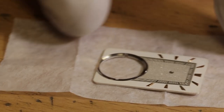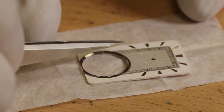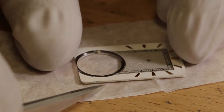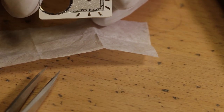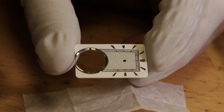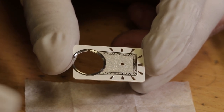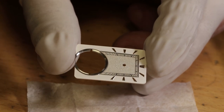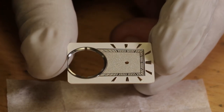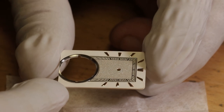You can see so much work has gone into the dial. Oh yes. And the minute markers, they are all... I actually engraved them on the pointer. Oh wow. And then I filled them with enamel, black enamel color. And then I did kind of sandblasting but grinding, like with aluminium oxide. Exactly, yes, the whole surface there. Wow, and they get that frosted look. I see. Ah, that's very beautiful. It's a very beautiful dial.